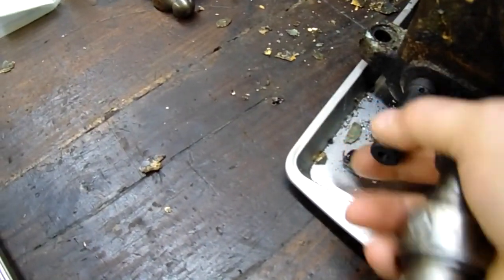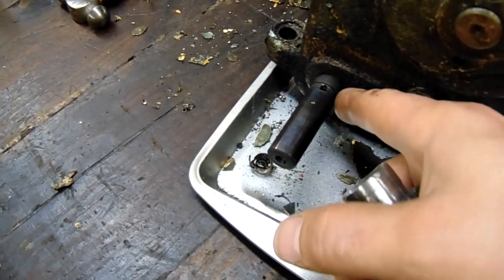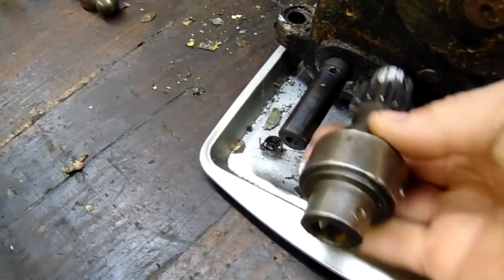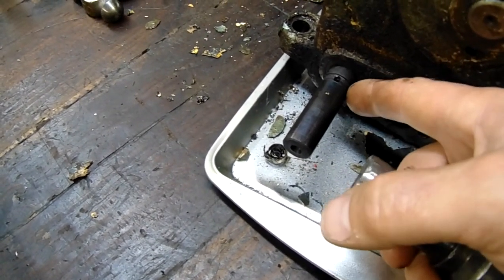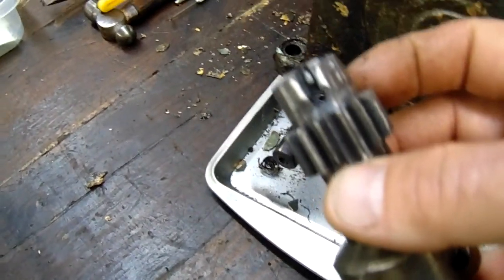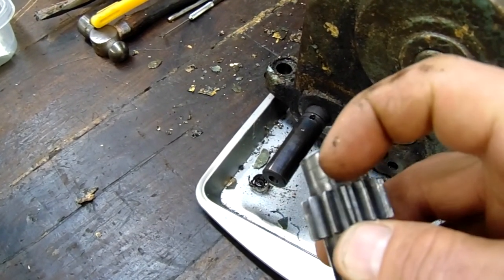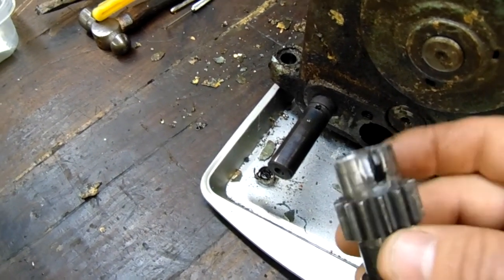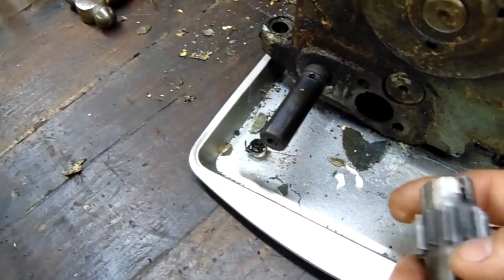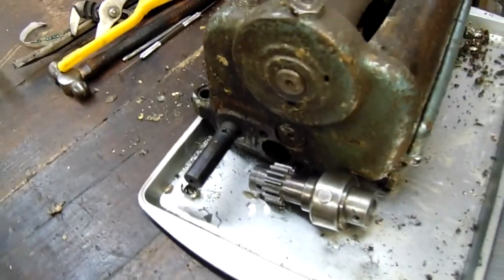It leaves us with a little cleanup on the shaft. I'll put the shaft in my lathe with a tool post grinder and take this down — take all the burrs and bugged-out areas off, clean this through hole up, and the shaft will be great. For the sleeve, all we have to do is a little cleanup, round it back out, weld it up, and grind it back down. Least amount of repair. We didn't damage the gear, the clutch assembly, or the shaft. That's a little tip when doing this stuff — always figure out what's going to give you the least amount of repair in the end.